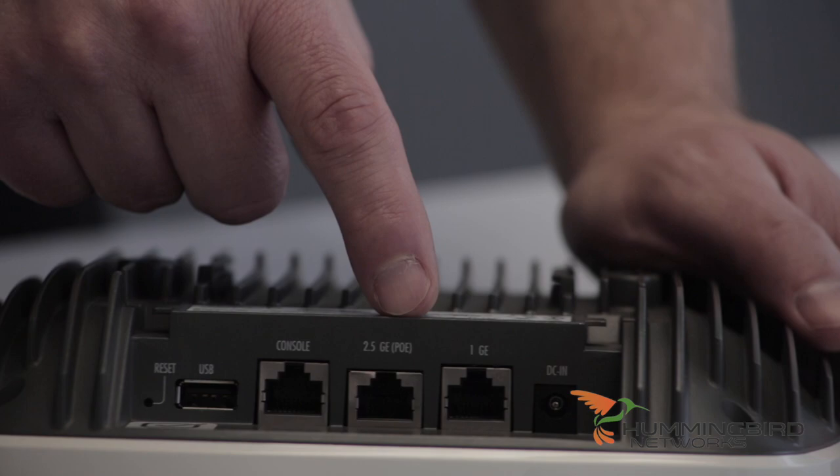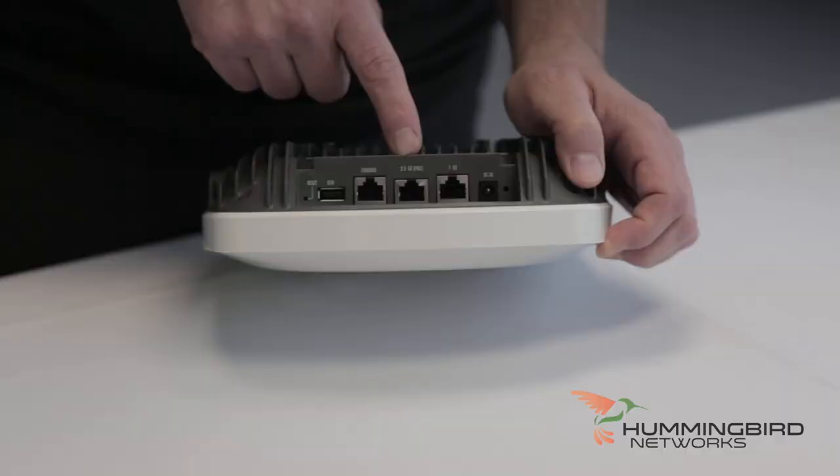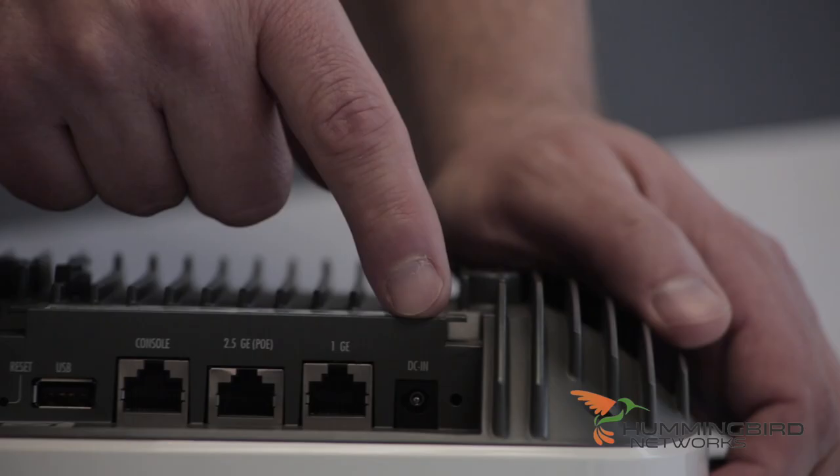Here are the interfaces on board: one multi-gigabit ethernet auto-sensing port up to 2.5 Gbps, and one gigabit ethernet auto-sensing port. Both ports are backwards compatible down to 100 Mbps. Some other 802.11ac Wave 2 products on the market do not offer a multi-gigabit ethernet port, instead offering only two gigabit ethernet ports, which require running two cables and allocating two switch ports — and those that do offer it do so at an expensive uplift. There's also a serial console port for low-level troubleshooting and a USB 2.0 port, with future uses possibly including LTE backup or storage.